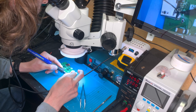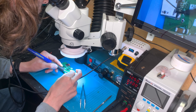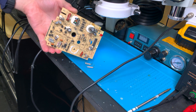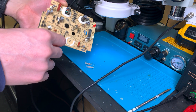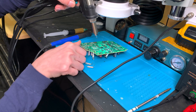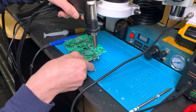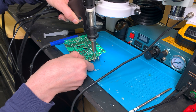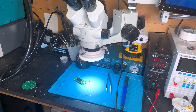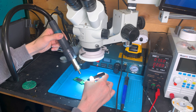The camera also has an HDMI out that I connected a small external monitor to, so I can position the board I'm soldering before I look through the microscope. The soldering iron I'm using is a Hakko T12 clone that I hooked up to a DeWalt battery, so I can solder things anywhere in the workshop. The desoldering gun is a generic Chinese model that works pretty well and has been really useful for desoldering through-hole components. And then I have a Kwik branded hot air station that I primarily use for soldering surface mount components, but also installing heat shrink or anything else a hot air station is good for.